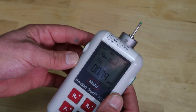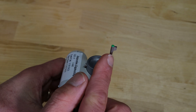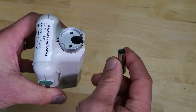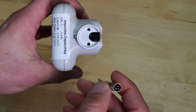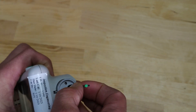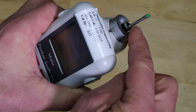Another important task is changing a stylus. To change the stylus, carefully grab it by the base — not the diamond tip — and pull it straight out; it will unplug. There are three pins that line up with three holes in the base. To install the same or a new stylus, carefully slide it down until it aligns, then push it in until it stops. You should never have to force this. Once in place, the front should be even with the front of the drive unit.